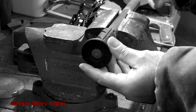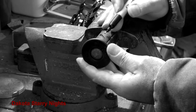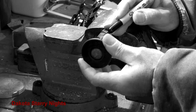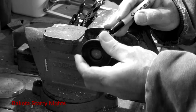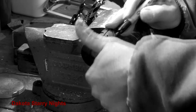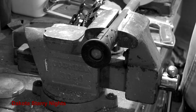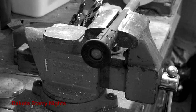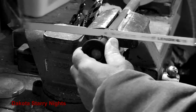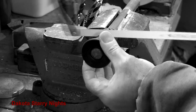I've got the dowel and the handlebar grip in the vise with the inch and a half marked right there. What we're going to do is hold the magic marker in position and just rotate this around to give us a guide line on where to cut so that we get it evenly cut. Now we'll take the fine tooth hacksaw and cut right down the middle of that mark, rotating it away from us so we can see the line and keep it centered.